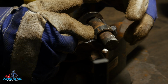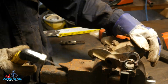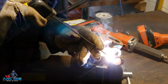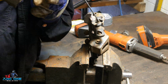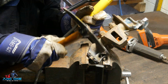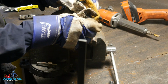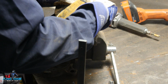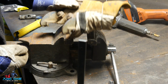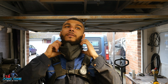It worked, but it doesn't fill me with confidence. I could have added more runs of weld onto it, but at a certain point you have to just draw the line somewhere. It was the second time that I had ever welded cast. I welded it around 50 amps, so whatever the box said, I welded it just above the amperage that it said is the lowest. It's a 2.5mm rod, and I should have wire brushed in between each pass, but I was just using the chipping hammer. It welded weird, really. I wasn't used to it. It's like the arc length couldn't be too close because then it'll stick, and when the arc length's too far away, it'll be like such a spray transfer kind of deposit. I wish I knew the theory behind things and had more practical advice so I could have done it properly, but I gave it the best shot I could.